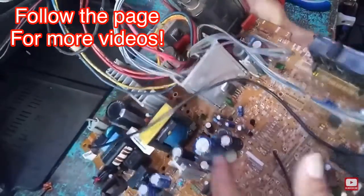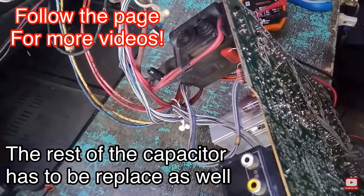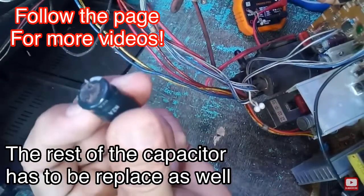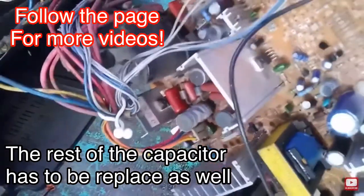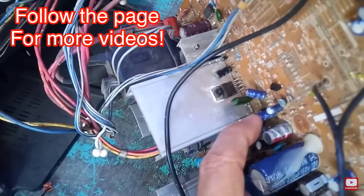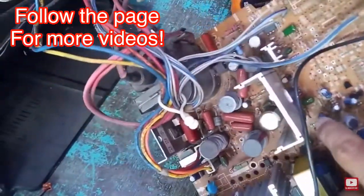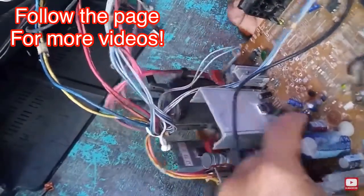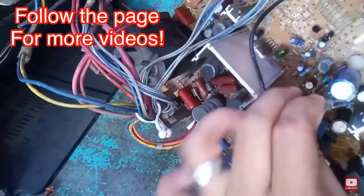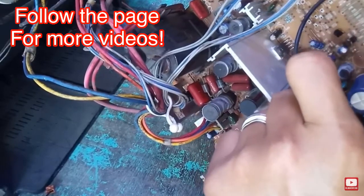I also checked this capacitor. Some of the capacitors are not good anymore, because the pin is open, it's corroded. Here, as you can see, the remaining pin of the capacitor is not working anymore. It's open. I also checked that some of the small capacitors are exploded. So we're going to change these as well. Okay, this small capacitor over here, we're gonna check it, and we are going to place the resistor into its respective place.